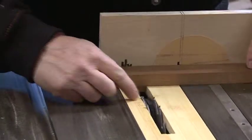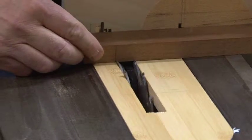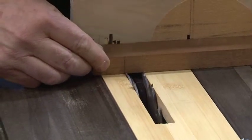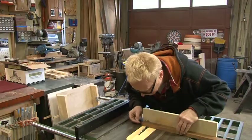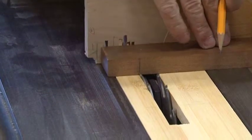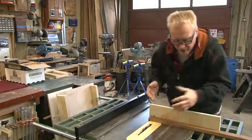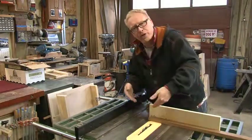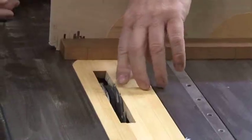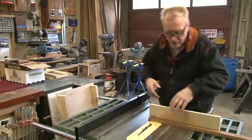I'm going to rotate my outside blade — make sure the saw is unplugged when you do this — and make our cut right there. You can see how that line on our outside blade is right there. Turn the saw on, make one cut, then adjust it, go to the other end, line up that pencil line with the outside of the opposite blade, make a cut, and then just hog out that middle.